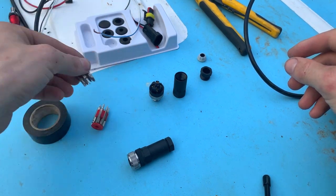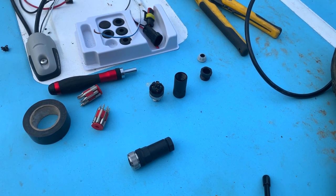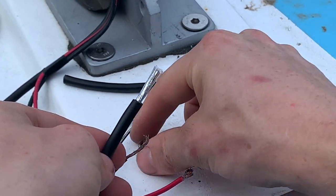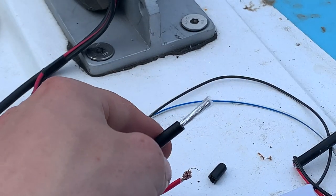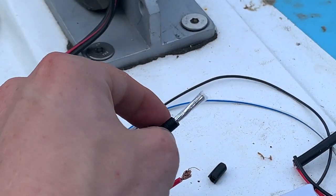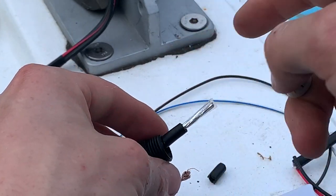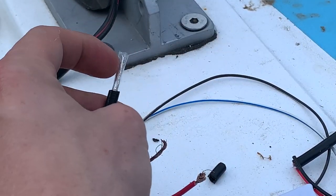I'm going to get my little screwdriver set, heat shrink the shield wire, and get all my ends cut to length and stripped with the stripper tool. As you can see I've taken off about two centimetres of the shielding, which protects the wire itself — the rubber seal will sit in there, squeeze down on the wire, and then this will go over. It allows enough length to connect up to the connectors while having the rubber seal sealed off, and enough room to move the wires around and actually connect them.